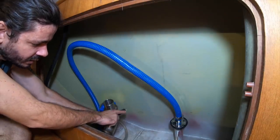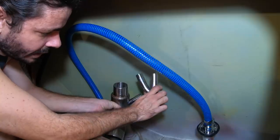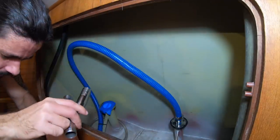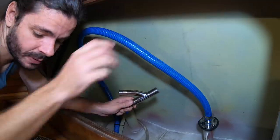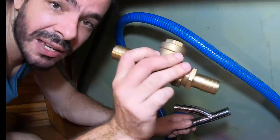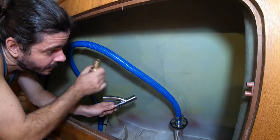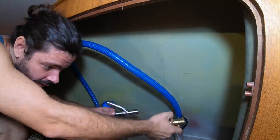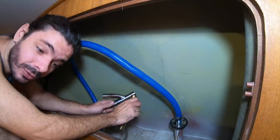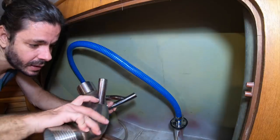We're going to have a hose here, and from this hose, we're going to go through this Y, and from this part, it will go to here. But we have this bilge pump, and for that, we're going to add a valve, because we want to make sure the water won't go back through the bilge pump. So we have a valve in between that will only let the water from the bilge pump come this way and not come back. And I think that's a good solution. This part is done. We can send it back to him and he can finish the weld.